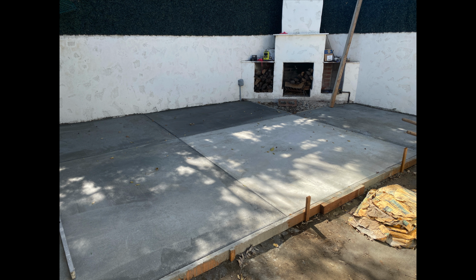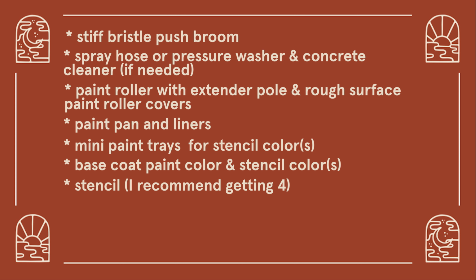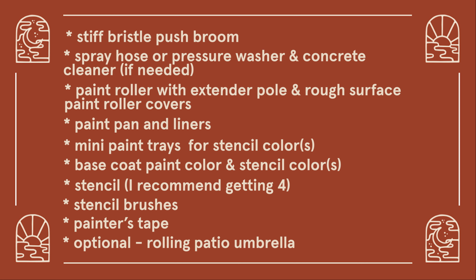So here are the supplies you'll need to take on a similar project. A stiff bristle push broom to scrub the concrete, a spray hose or a pressure washer, and concrete cleaner if you want. A paint roller with an extender pole, which will make painting your base coat far easier on your back, and some rough surface paint roller covers. A paint pan and some liners, some mini paint trays for your different stencil colors, your base coat color and your stencil color paint, your stencil, which I recommend getting at least 4 of them so you can work in batches, some stencil brushes, I put a link in the description to the ones that I found worked best for me, some painter's tape to tape down your stencil, and then lastly, this isn't necessary, but a rolling patio umbrella really saved me from getting major sunburn during this project.